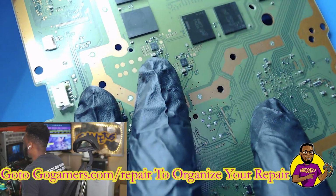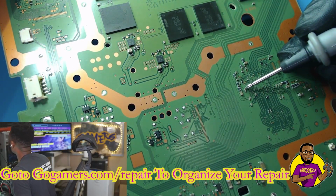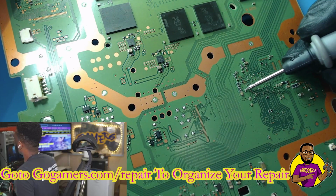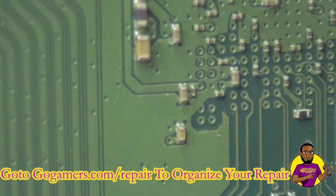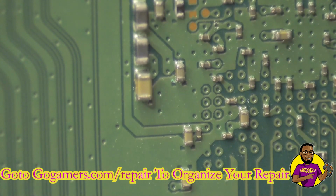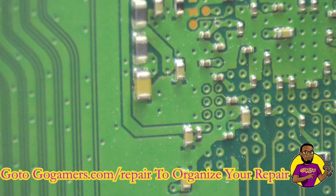All right, so the section of the board that we're going to be looking at is exactly where my pointer finger is at. There's a little component right here, where if this component is shorted and is not receiving the proper ohms, then that means the Southbridge has gone out. So that's a little tip if you ever want to figure out if your Southbridge has gone out on a PS4 Slim. If this component is shorted, then it won't work. So let's go ahead and first off get better lighting. Now let's test out that component.